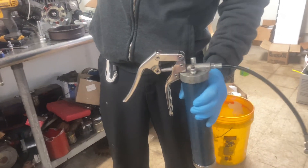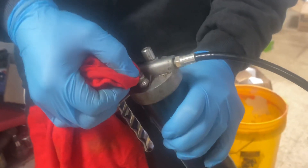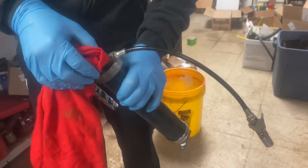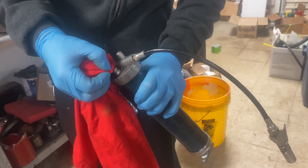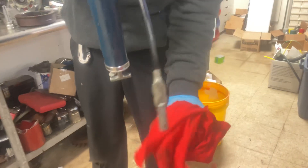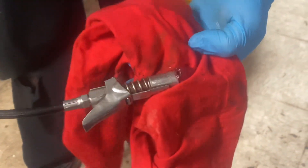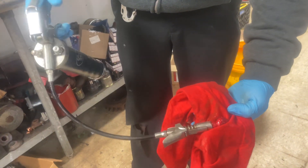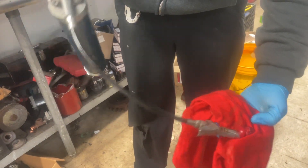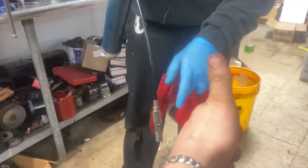I have a little air vent here. I'm going to take our rag and push down on this plunger until we see some grease come out. As long as there's not a huge pocket of air, it shouldn't be that bad. See some good grease coming out. Now I'm going to squeeze the output and actuate the grease gun. I don't feel any resistance yet — and there it is, now I feel some resistance. See that little air bubble that came out and the grease change color a little bit. Now the grease gun's ready to use. Should take you five minutes or less.